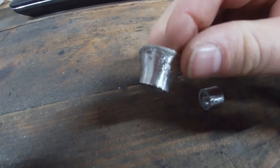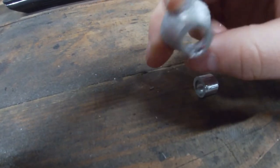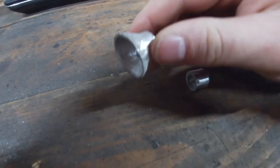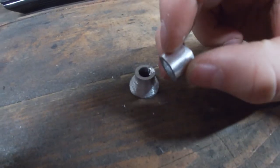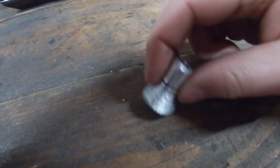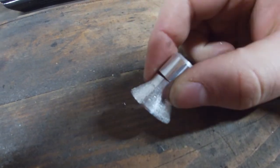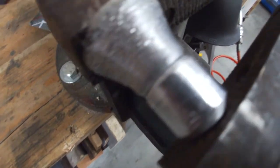These are the parts. There's a little bit of vibration on one axis, which is why I have some chatter on the part, but it'll be saveable with some sandpaper — nothing too big. I'm going to grind a little chamfer on these edges and try to solder them together. You should be able to solder aluminium, so that's what we're going to try. There we go — we have a chamfer on the parts.